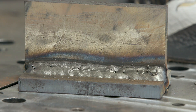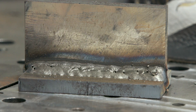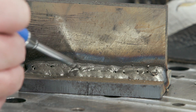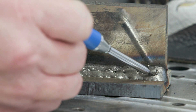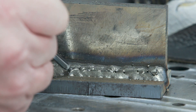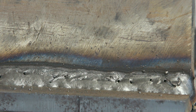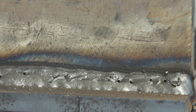Let's talk about wormhole porosity — also called gas marks, chicken tracks, or worm tracks, whatever they're referred to in your area. Basically, these are little striations where nitrogen is escaping the molten metal and rising up, causing a surface discontinuity — very unappealing. We're going to dive into some of the additional causes of this and how we can go about fixing it and hopefully avoiding it altogether.